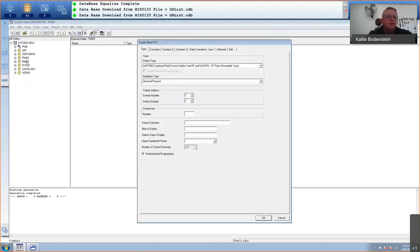there. So if you take a look at all these icons, you'll see that these look like a hard disk. These are actually user-defined projects that can only be used for training and with test function. But that is my real project. That is the one connected to the FCS. So in your plant, you'll probably only have the one project, which is the one live in the FCS, and the others are user-defined projects. Now, there is a project attribution utility where you can swap these projects so that another one will be in your FCS. But for now, I'm just going to work on the hard disk, and then later we'll switch back to the one that I've already programmed once I'm done.